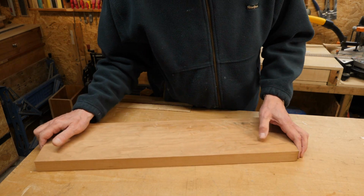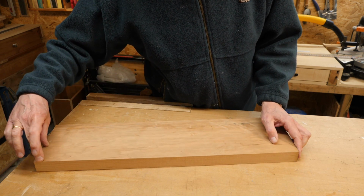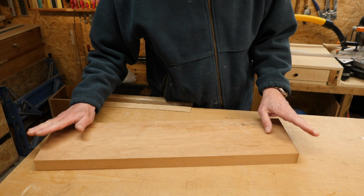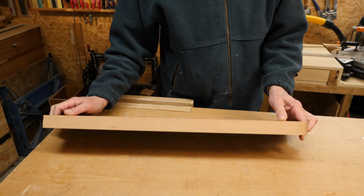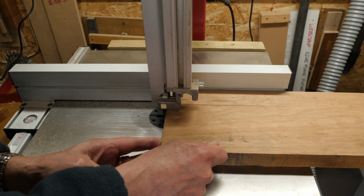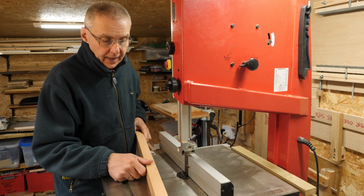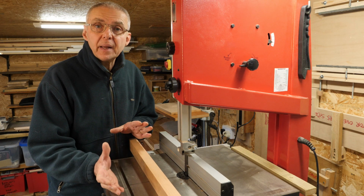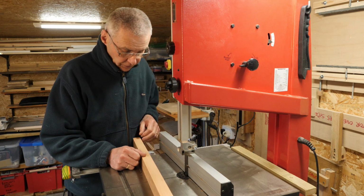Now then I need to cut the wood for the sides, and well, it's going to be 45mm deep, the side, so I'll cut a strip a bit wider, and then create some thin sort of veneers from that. I think I'll cut these strips to 5mm thick, and then just run them through the thicknesser to get them down probably to about 3mm, because I've got to bend them obviously, so I don't want them too thick. I think I'll also take an opportunity to cut some wood for the kerfing as well.